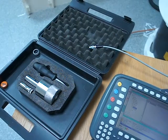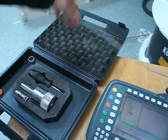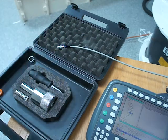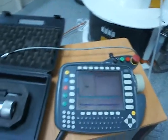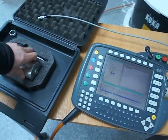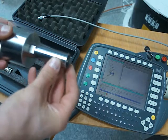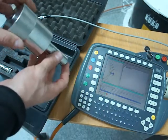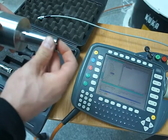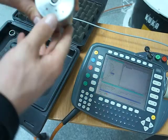To master we need the EMT tool — this one — and that is connected to the robot base in a connection called X32. It's here on the back, down there behind the robot. We need to connect this to the robot while it's moving. This is a mechanical switch, a sort of electronic tool with a little pin that goes into a little metal notch on the robot, as illustrated here.